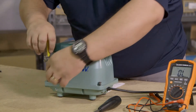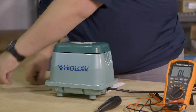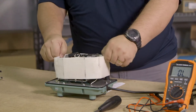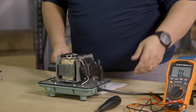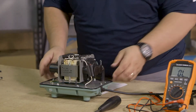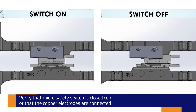I'm just going to take my eight millimeter and finish taking out these screws. We're going to take off the lid and remove the sound absorber because it doesn't do us any good. Now that we've verified that the power has been removed and it's safe to be inside of here, what we're going to do is just quickly do a visual check — was my safety switch tripped? In this case the answer is no. In a minute we'll trip it to show you what lack of continuity looks like.